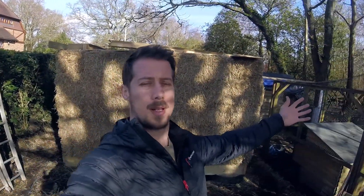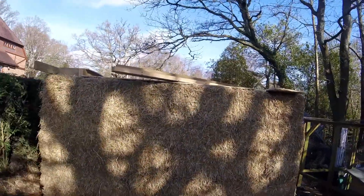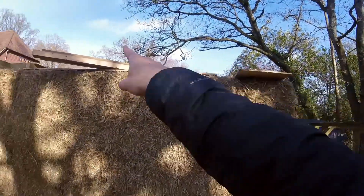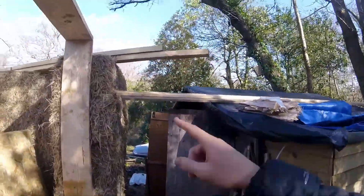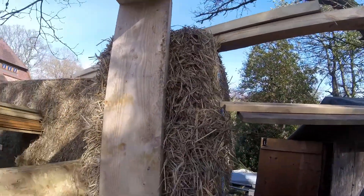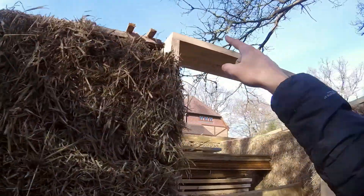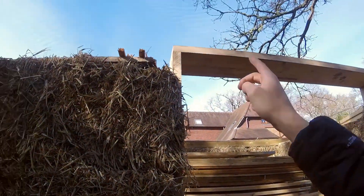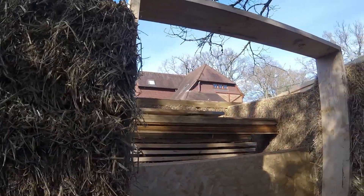We've finally got some nice weather today and it's going to be nice for the rest of the week, so the tarps are off. We're finishing the box beam that goes across here — we've got some of the wood there. As I mentioned, we're going to resize the door down to that line there — take it down five centimetres. Do the beams on these shorter sides, the box beam joins across the top with a board, and it's going to be screwed into the side of the door up here. We'll do this one, then that one, then the ones that join them across the middle.